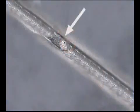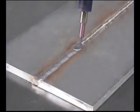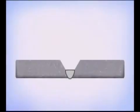Anytime you weld in a bevel, you want the filler metal buildup uniform. If there's high spots from stopping and starting, use a grinder up on edge to even up the weld. Depending on the metal thickness, you may be able to finish in one more pass. With the gun angled and a slower travel speed, build up weld slightly wider than the bevel and above flush with the surface. For heavier metal, run as many beads as it takes.